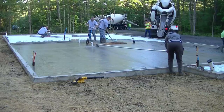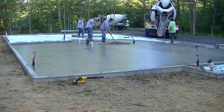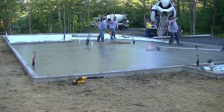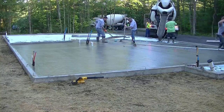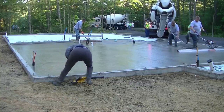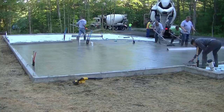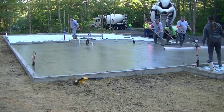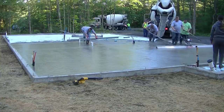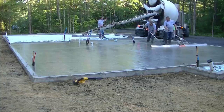Now I'm using a little stand-up screed we made — about a six-foot screed with a bull float handle hooked to it. Now I don't have to bend over and kick my feet; I can just pull the concrete towards me and fill in behind the screed as needed. Luke's getting ready to use the Screed Demon again to come down that bay while I hand screed the middle piece by all the pipes. The stand-up handheld version does leave the surface a lot more coarse with aggregate, which means you might have to bull float it a bit more to get that aggregate down.